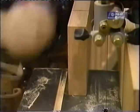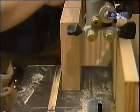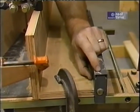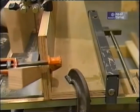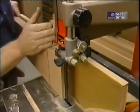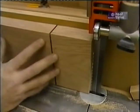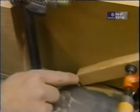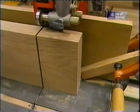On the band saw, if you try to hold a board that's only an inch and a half wide perfectly perpendicular to the table surface, it's not easy — it wants to rock. Even the standard rip fence that comes with the saw is only two inches high. So I've made a jig: two pieces of plywood screwed together at a perfect 90-degree angle to hold my piece correctly in line with the blade. I've set the fence the right distance away so the material falls away rather than getting jammed in the blade. It's a one-inch band saw blade, and I've installed a stop block to prevent me from going too far and ruining those nice shoulder cuts. It works great.